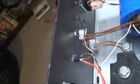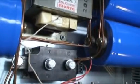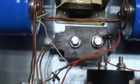The power supply has been retrofitted with clamps to the banana plug connectors instead of soldered — that'll eliminate the solder melt. The clamps are probably steel. Make sure you don't use aluminum clamps to clamp the wires. Over here was where the one connection burned out, and there is a good view of the new SCR I'm using these days.